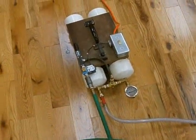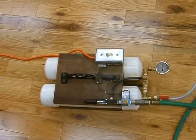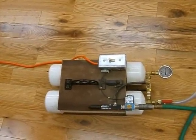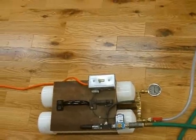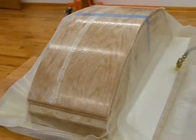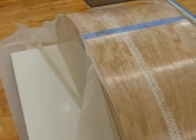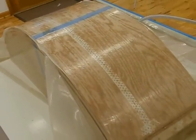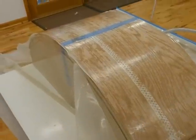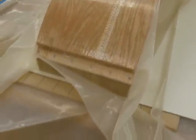Here's a close-up of the vacuum pump. This is one I made with parts I got from veneersupplies.com, also known as joewoodworker.com. He sells the parts plus directions on how to make it — all you need is a compressor. Right now I've got about a little over 25 inches of vacuum. While you weren't looking, I took the nylon mesh out of the bag because I had put on so much glue that it was bleeding through the oak — the mesh would have stuck to the glue and I would have had a big mess. Now the polyethylene bag is up against the oak, and the glue won't stick to the polyethylene. Any little bit that ends up there I just peel right off.